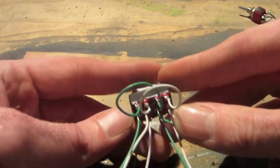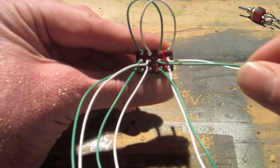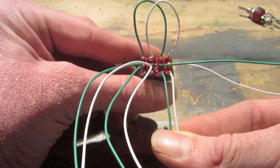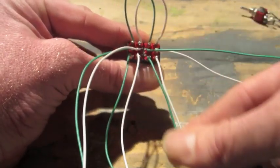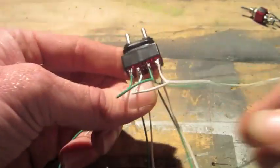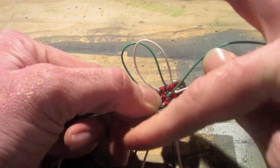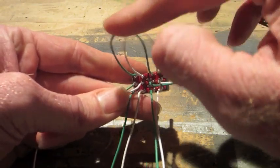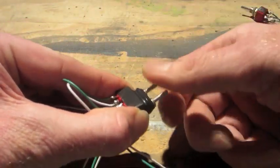Okay, so here's how I did my bypass switches. I have two toggle switches. I'm going to mount them in the case side by side. So this is the input signal, and then this is basically like a loop out signal, and then a loop back in. So this goes to one effect, the audio signal comes out and then comes back in, and then this is back out to the next effect. When it is up, the signal is connecting down and back around, out, and when you toggle down and bypass, signal comes in, routes around the top, and then on to the next. You just have to make sure to switch both at the same time.